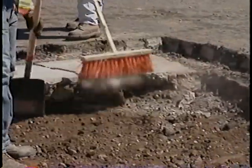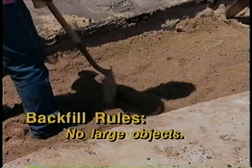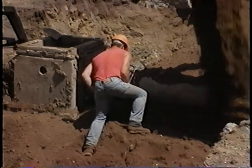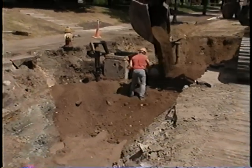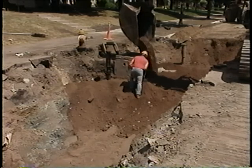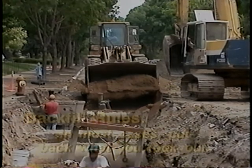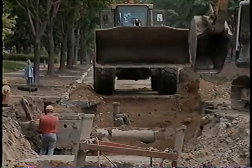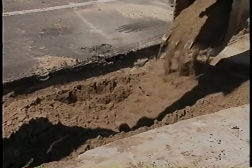When you've finished your repair work, it's important to think about what you're going to use for backfill. First, most specifications say you must use approved backfill material devoid of any large objects, and that's especially important for the fill you put under and around a pipe or cable. The biggest piece you should put into the hole is about three inches in any dimension, and try to eliminate anything sharp — the impact of compaction can easily cause a rock to puncture a cable or pipe. In most cases, the fill that came out of the hole is the best thing to put back in. It's important to have consistent soils under pavement so there will be consistent responses to temperature and moisture changes. If there are different kinds of soil under the pavement, they may expand and contract differently, leading to either settlement or heaving.